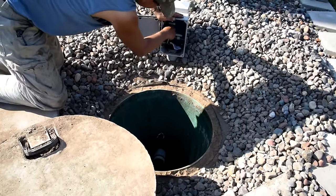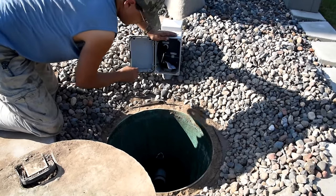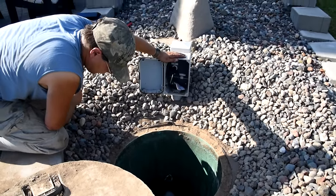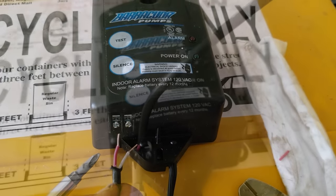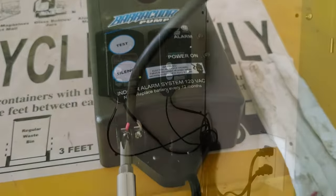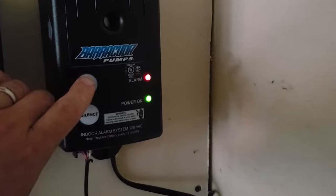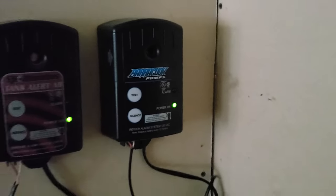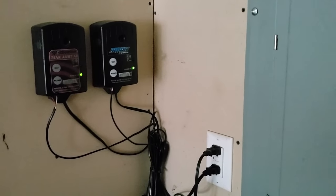In this situation I've got enough water in the bottom, so I'm going to plug it in straight on first to test the pump, and then eventually I plugged it into the floats and let the floats control it. Then it was just a matter of putting the cover back on and heading up to the garage to put the alarm in. The alarm is simple — it's just a bell wire with red and white. Screw it onto the wall, hit the test button, make sure it screams at me, and we're pretty much good to go. I have two alarms because I have two different septic systems here. That's as simple as it was, folks — thanks for watching. Please like and subscribe.